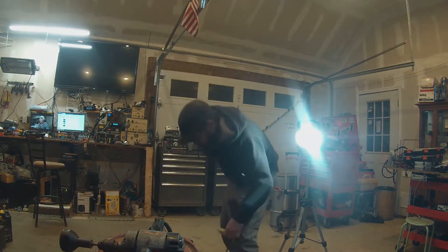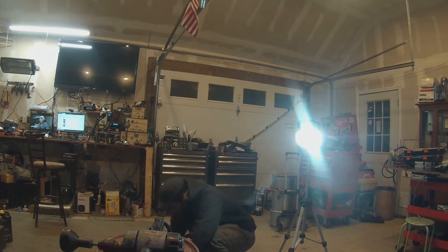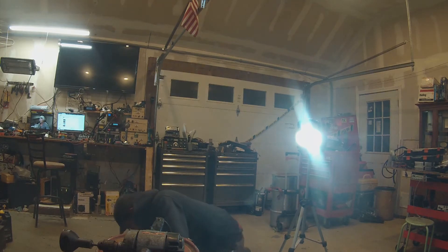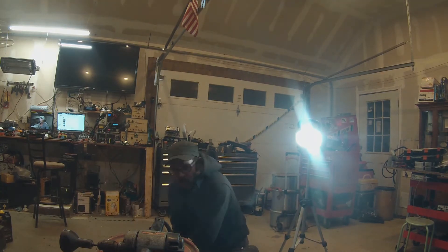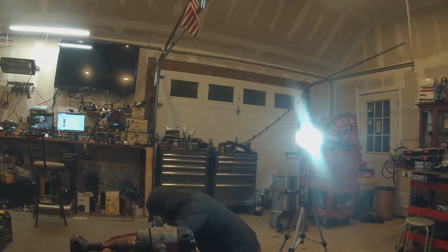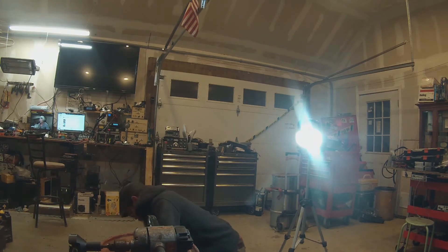Here's my high-amp drill. Once I get it running, I twist the drill in, click the trigger on, and it recharges the magnet — remagnetizes the generator. It usually brings generators back to life. In the meantime, with this one you've got to redo it every time.